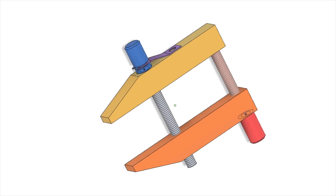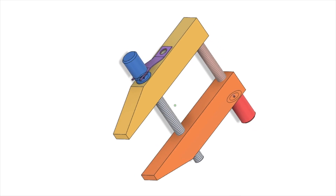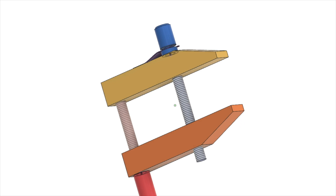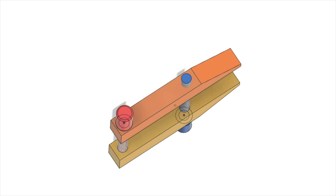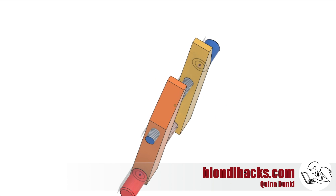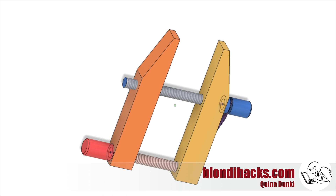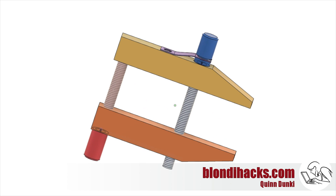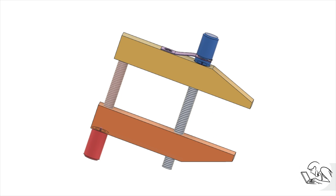In my research in a whole bunch of old books on the subject, I found that there's basically one main design for these toolmakers clamps. There's a clamping screw at the front, and then the back is actually just a pivot screw — it's in a blind hole, acting like the back support on a strap clamp. This is pretty straightforward and easy to make, so this is what I set out to do.